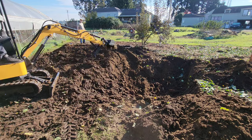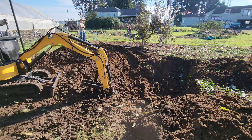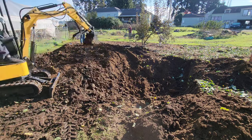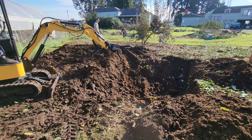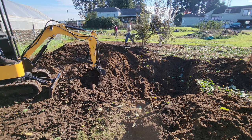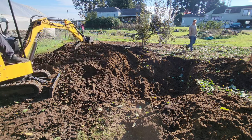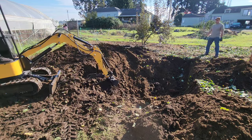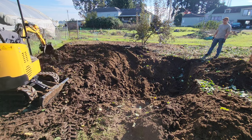And if you start pumping in 200 degree oil, that's going to wear down the rubber seals and prematurely wear out those hydraulic cylinders. So cooling these things is important. If you're running this in a hot environment, go on Amazon, eBay, wherever you like to buy, find some 7-inch cooling fans and zip tie them to the side.